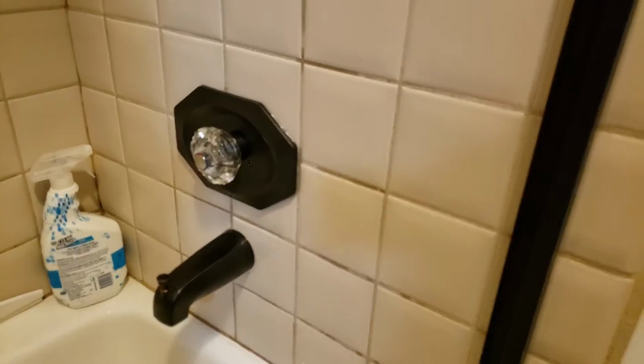So it's all installed. Run plenty of water down there. Everything's hooked up correctly. We did silicone a little bit around the edges, all the way down beyond 180 degrees, down past here. We just like to make sure no water gets in behind. It does have a large rubber gasket there, but when you get a grout line, it just sneaks past it, things like that. Same thing with the spout where it comes out, just siliconed in. So let's give it 24 hours, that'll be dry. It's sticky enough to where water will roll off it, but don't wipe that right now because you'll wipe that out. And then of course new putty down in the drain assembly.